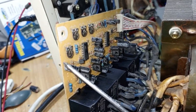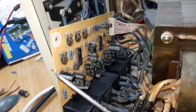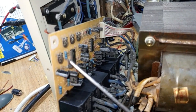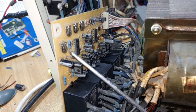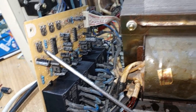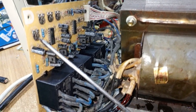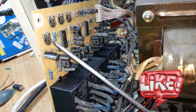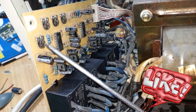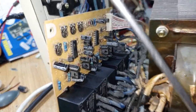If you wind it to one side, you will take the voltage down to the normal voltage you are measuring at that point. But if you wind it the other way, it will adjust the voltage to a high voltage. So when you notice it is showing a high voltage, take it down. You will hear the triggering sound of the relay and it will fall back to the low voltage — meaning you are at the right point.